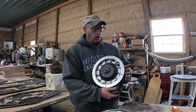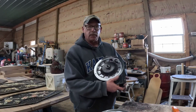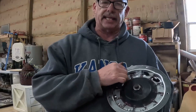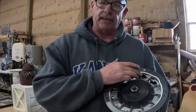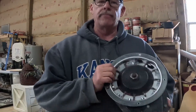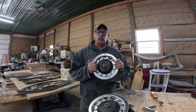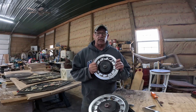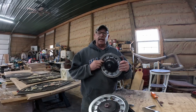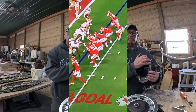What I've done is replaced my brush and replaced the back plate. As you can understand, when you get two or three seeds riding along, that one seed is going to go bump bump and the brush will knock one off. Having these calibrated gives me just as much of an advantage as much of the newer equipment that costs hundreds of thousands of dollars, and I've done it for under $500 here today. If you like these types of videos, go ahead and hit that like button, subscribe, and come grow with us.